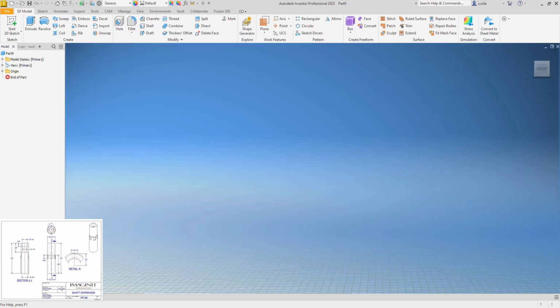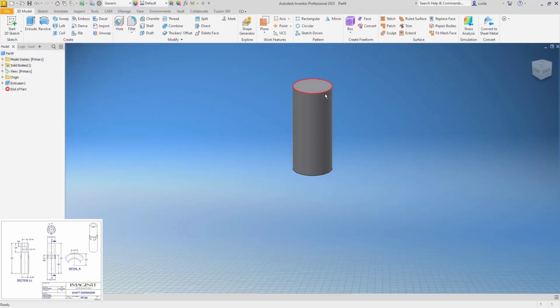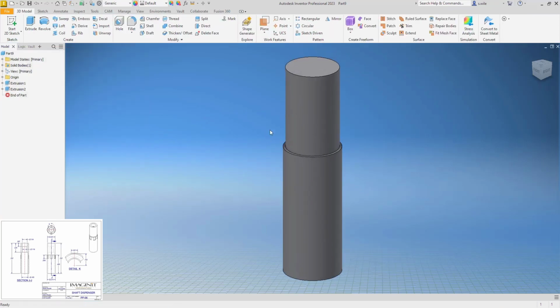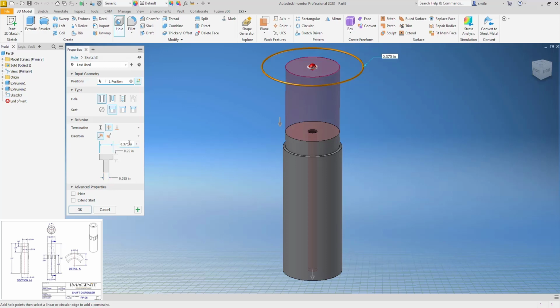PP06, ABS plastic. I think I'm going to start with 2 cylinders stacked on top of each other. And another sketch for our next cylinder. And it is 0.787 minus our first cylinder, 0.48. I'll do the inside while I'm looking at it like this. So I'll put a hole through here and say counter bore. We'll do the 2 top sections going through there. So the counter bore diameter is 0.134 with a depth of 0.087, and the overall, or the through hole, would be 0.118.